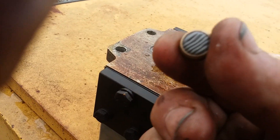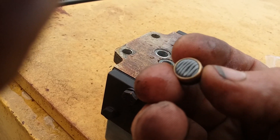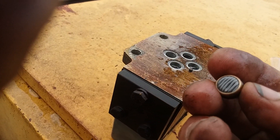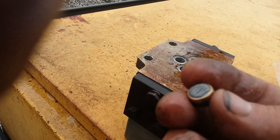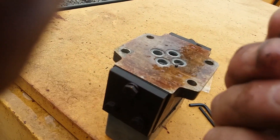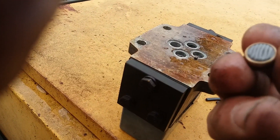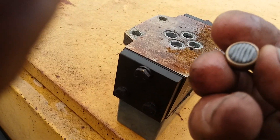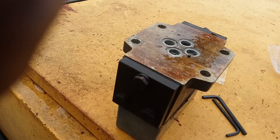If you're having some difficulties and you're getting some irregularities in your jack beam, your jacking cylinders or your lining cylinders, this is a good place to start. These things are wee tiny and they plug up. So this is a good place to start diagnosing that. Replace these filters before you do anything — see if that makes a difference.